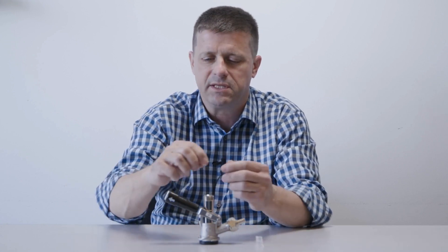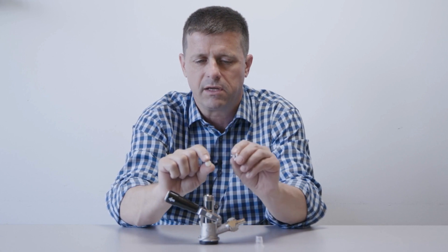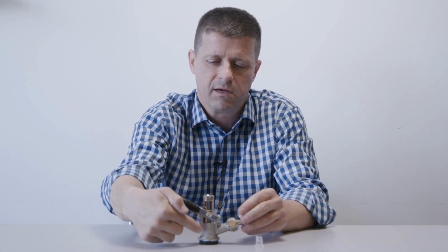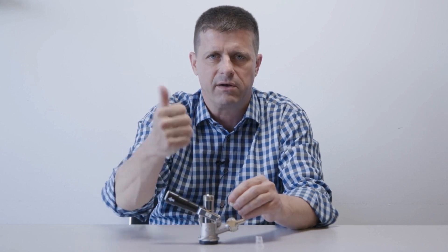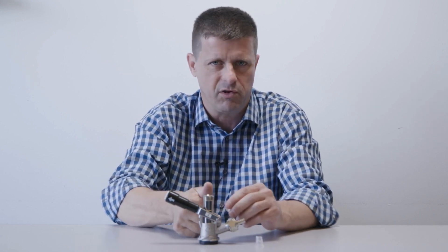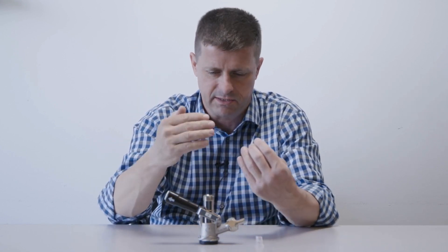The other critical piece is this combination of the check ball and the check ball retainer. The check ball floats freely within the probe, and the check ball retainer sits in the top, keeps the ball contained within the probe, and doesn't allow it to enter the beer line. This allows the free flow of beer forward, but if you untap the keg and there's still beer in the line, it doesn't spray out of the bottom of the coupler all over the place.